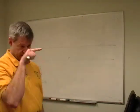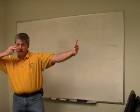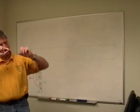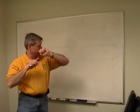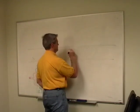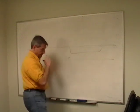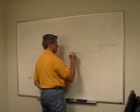And in the oven, there could be an ion implantation where they have this ion source over here, and it's a big, like the inside of a TV tube. Oh wow, I'm getting old. High differential voltage, a hot source here that boils off atoms, and they zip that way, just like a machine gun, bing, bah, bah, bah, and all the atoms come over here and bang into this, and what you get is an implantation. And so these would be N wells. So this would be like an N plus.